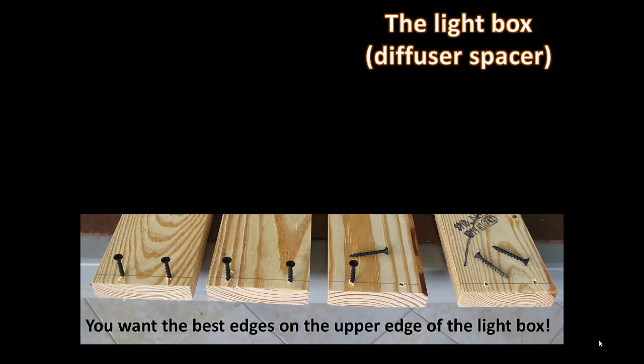If your outside dimensions are 24 by 72, then you're going to need to end up with a frame that's 24 by 72. If you're going to overlap your joints, as I did, then your frame components are going to be the dimension of one side minus the width of the other piece on the corner. For a 1x material, 24 inches minus 3/4 of an inch is 23 1/4. And for the 72-inch side would be 72 minus 3/4 of an inch, which is 71 1/4 respectively. So what I did was I cut 2 boards to 23 1/4 and then 2 to 71 1/4. That way when they're butted together, you end up with 72 by 24.